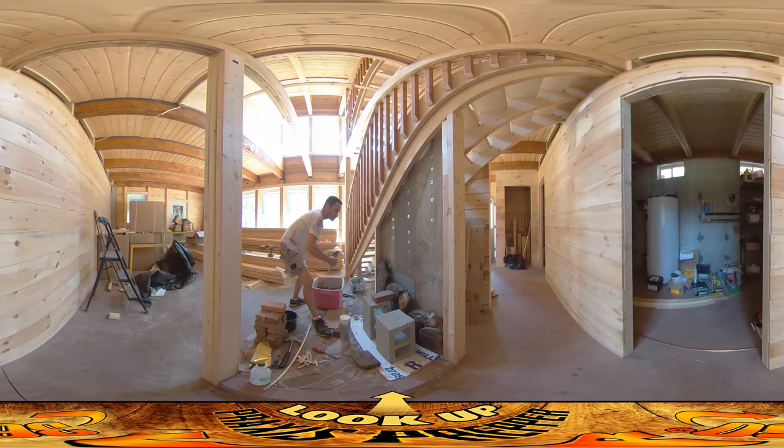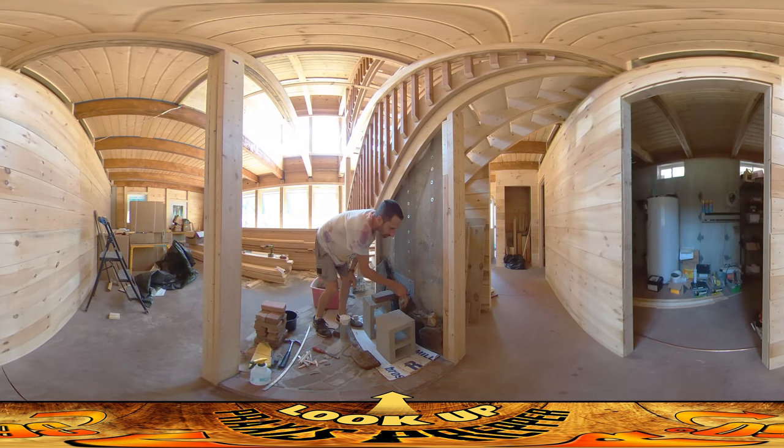For this one, since it's not too tall, I'm not going to bother pushing up a bunch of mortar on the back. I might just do a little bit at the bottom, but most of that's going to get filled in by dropping the concrete in from the top. You just want to agitate it a little bit so it goes down and fills in the voids on the rock below. The rock above is going to be moving but the rock below is set, so I just give it a little wiggling motion with the cement.